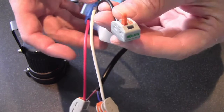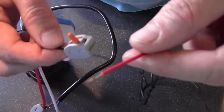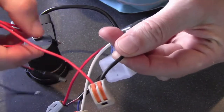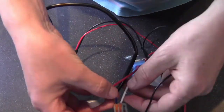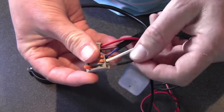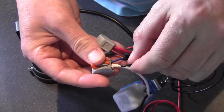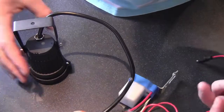And then you've got the remaining black connector. The black connector goes to the live of your power source — so that goes in there. Your black from your sensor goes to the live, your red on your power source. That leaves one hole free on your three connector. In there, you put your black from your power source. Give it a little twist so it goes in there nice and cleanly. There you go — and that is how you connect it all up.